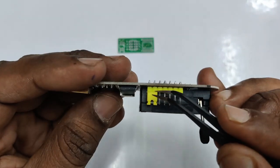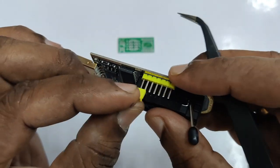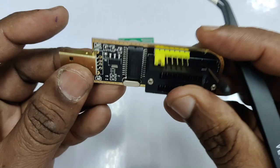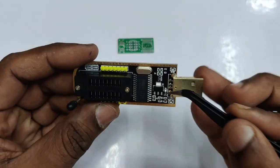There is a jumper which is placed at pins 1 and 2. This jumper should always be present — if it is not there, the USB cannot communicate with the IC on the holder. So this jumper is very important.